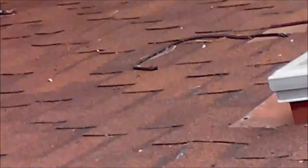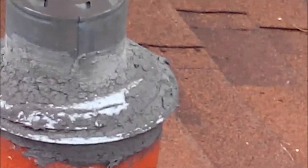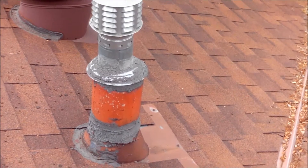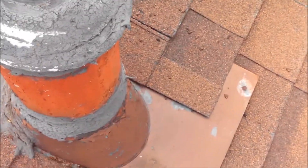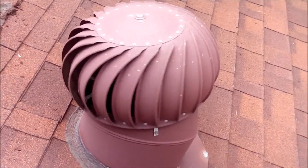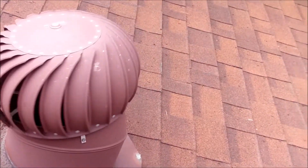It's one layer of roofing. I looked in the attic and they have plywood underneath the composition shingles. The flashings on the vents — plumbing vents and exhaust vents — are metal, so this is done right. You have a whirlybird and also gable vents, so that's all done properly as well.